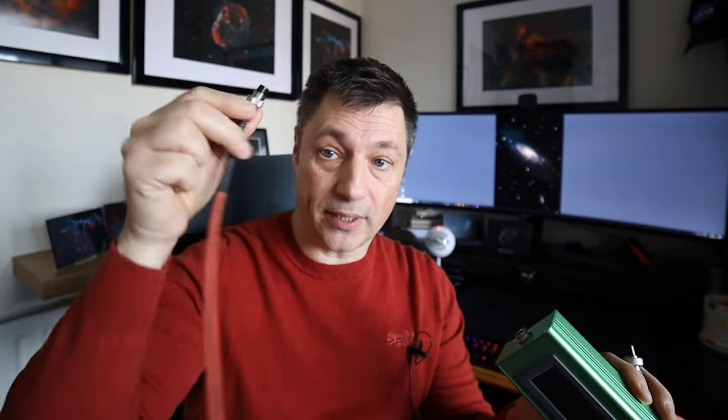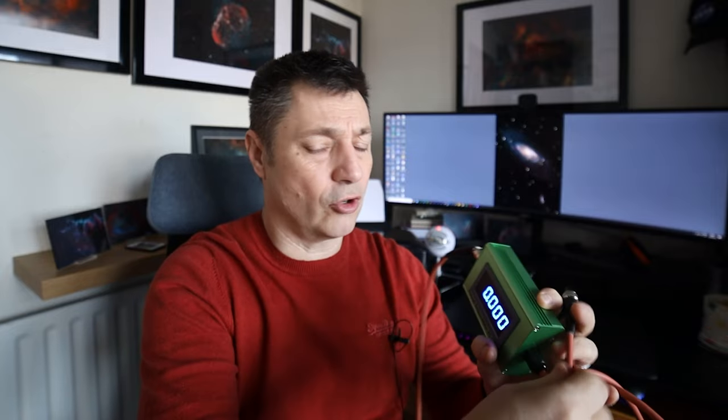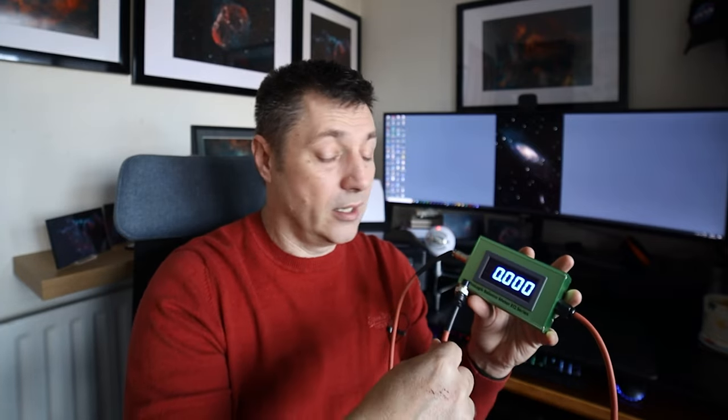Let me plug it in and show you the display. This is the power that would normally go into my mount - it goes straight into this unit and you can see it light up straight away with a lovely big clear display. It is important before you use this instrument that you have a nice clean supply - you don't want any numbers jumping around, you want this to be nice and stable. This end, coming out of the unit, goes straight into your mount and gives you a reading of what amperage your mount is using when trying to slew.